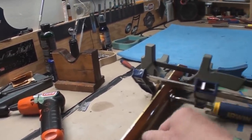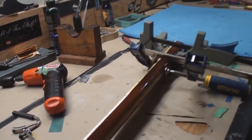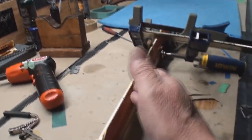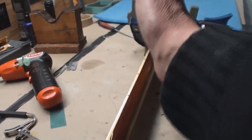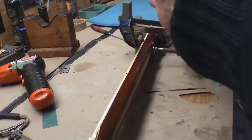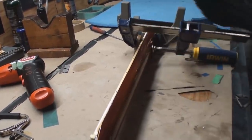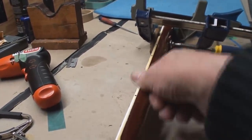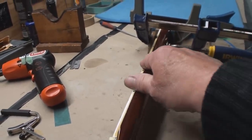Which is another repair where the transition is between the binding and the actual neck. So after looking at it a lot, the wood of the neck was straight. And because the fingerboard had separated — I don't even want to know why — it had sort of done its own thing because it was left open grain doing nothing. So I decided to rely on the straightness of the wood and glue this sucker back together.